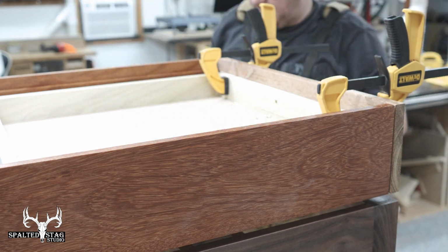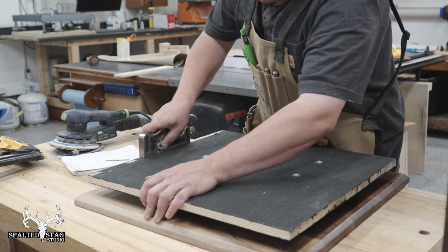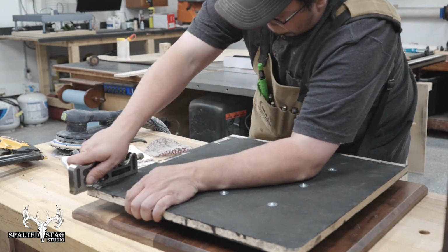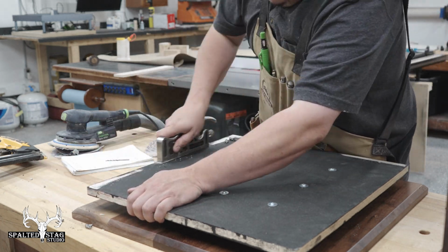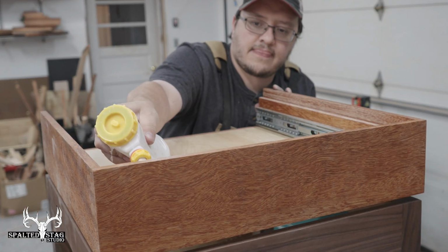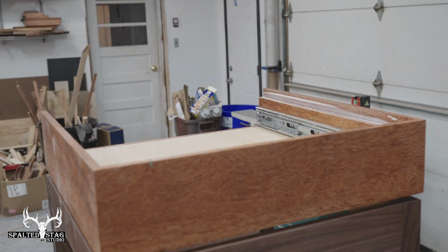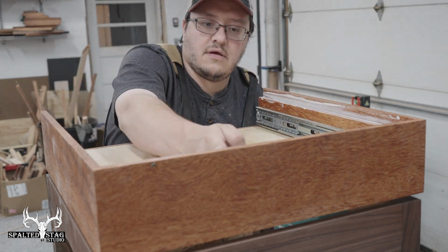This is why I really didn't need to stain the bottom. I ended up having to scrape some off with the plane anyways. Wanted some bare wood, that way the glue had something to bind to. I need to be really careful that I apply enough glue to bind, but not enough to get some squeeze out. The back it's fine, but on the sides, if that squeeze out got into the drawer slides, it could ruin them, and there will be no way to replace them.